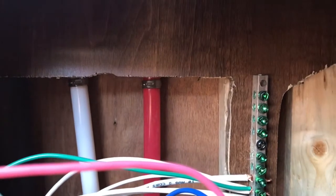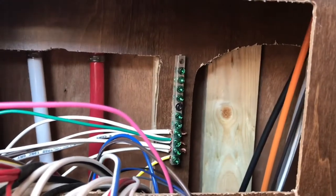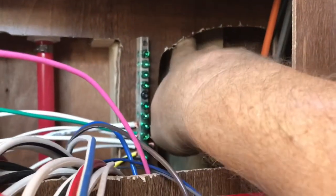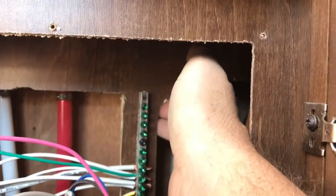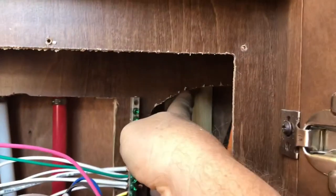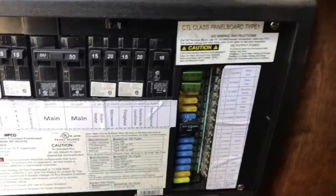Okay, so you see we have this control panel off now. It's a very good thing I looked, because what do we have right there? Water pipes. And notoriously, I'm famous for cutting into a wall and drilling right through a water pipe. So it looks like right up in here I have good access in this space to run a wire up to put a little plug right there, but I'm going to double check. Feels like I have a decent stud there to nail to, or to at least secure my connection. I can easily run wire there. I've got the bus for the common and the ground right there, and then it's not too far to go to my main circuit panel.